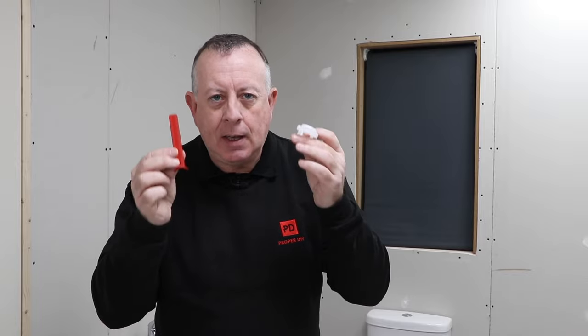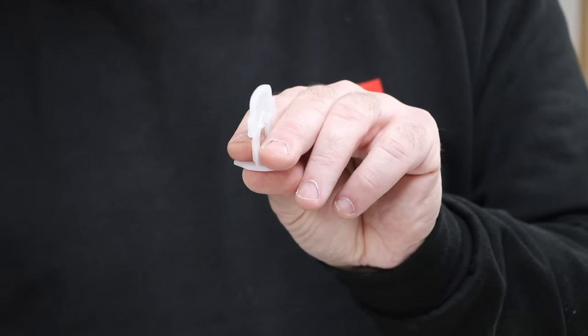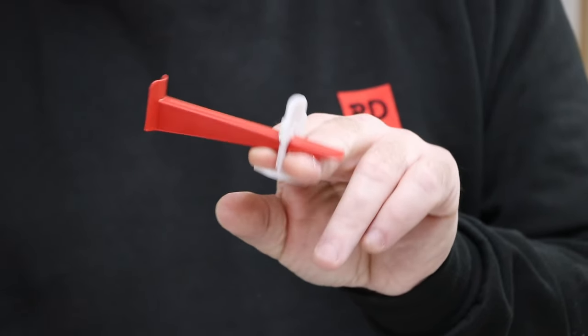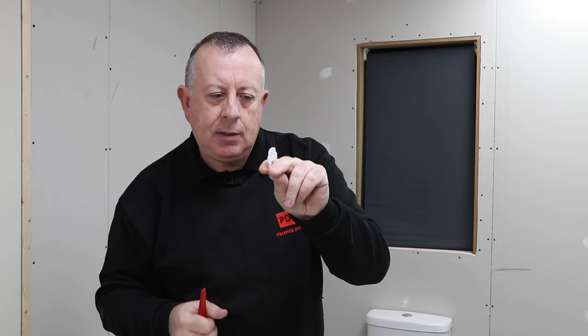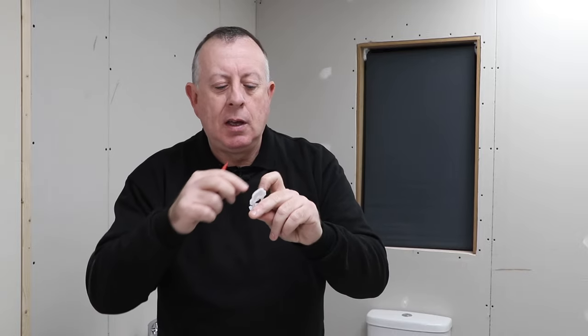The other product I would highly recommend to help get your floor tiles flat — although it can be used on wall tiles as well — is the leveling wedge system, and it comes in two parts. The first part, the clip, sits underneath adjacent tiles and then the wedge is forced in bringing them level. Once everything's got some strength the wedge can be removed and reused, and the clip stays in but with the top being knocked off, which means it's completely invisible and can be grouted over so you'll never see it again.